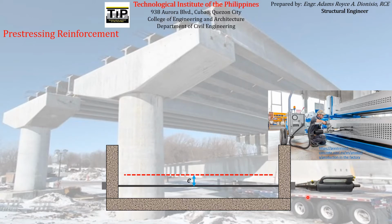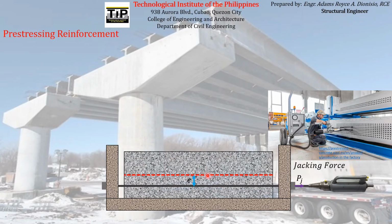That hydraulic jack will tend to pull this pre-stressing reinforcement, and because of that, a jacking force is being applied to, or experienced by, the pre-stressing reinforcement. Due to that pulling, a jacking force results that is experienced by the pre-stressing reinforcement all throughout its length. After the pre-stressing reinforcement is pulled, thereby imposing what we call jacking force, the concrete will be poured